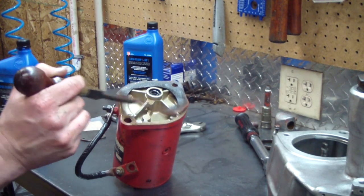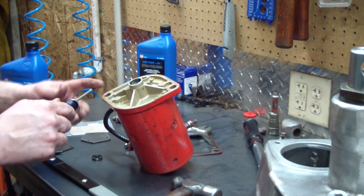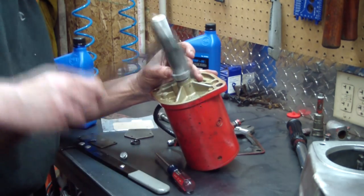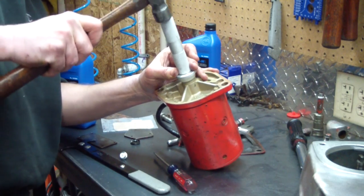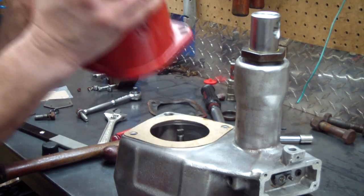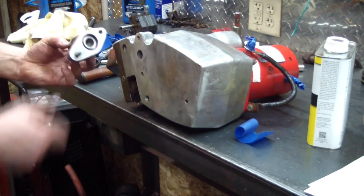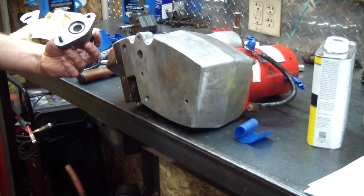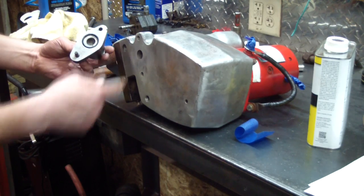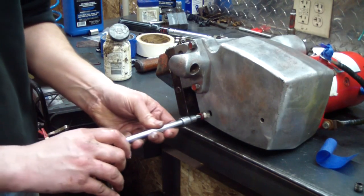I'm going to go ahead and stick the pump in the case now with the o-ring over the feed hole. Here's the motor — we got a new gasket for the reservoir and there's a seal in here that the kit came with. Driving a screwdriver underneath it got it up pretty easy. There's a taper on the seal so it looks like it was in there the right direction — I'll try to put the new one in the same way. I'm putting a little bit of hydraulic lube on the shaft before seating the motor. Here I'm getting ready to put the base lug on — there's a new o-ring in there. I found that all the crap accumulates down here like sludge and moisture, so a tip might be to clean that area out every other year. There are a couple more plugs that go in the bottom.